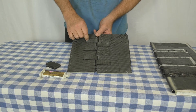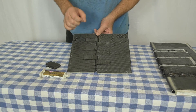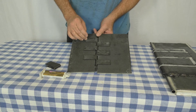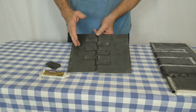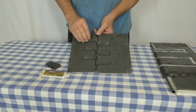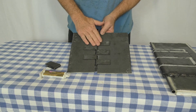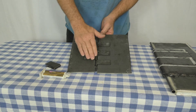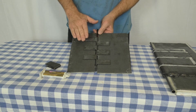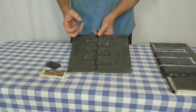However, on a couple of these lugs, I'm going to drill through in a couple of spots — sixteenth-inch diameter holes — and I'm going to bond in sixteenth-inch diameter pultruded carbon fiber rods as shear pins. Just in case the bond should fail prematurely, we'll find out whether the shear pins make that attachment any stronger or not, whether they're actually needed. My preference in building the aircraft is simply to bond parts together — it's the lightest weight way to do it. And there are so many lugs involved in the system that there's redundancy.